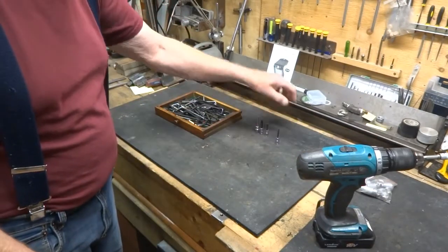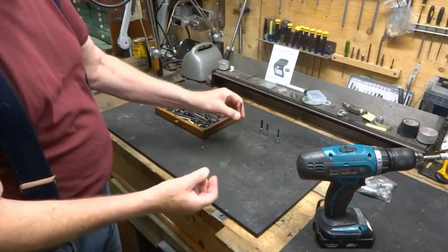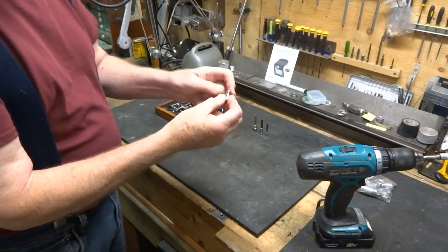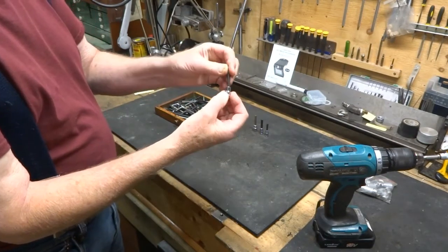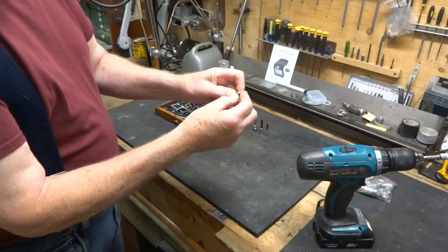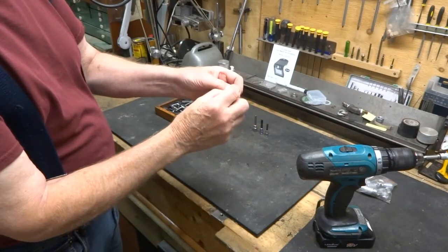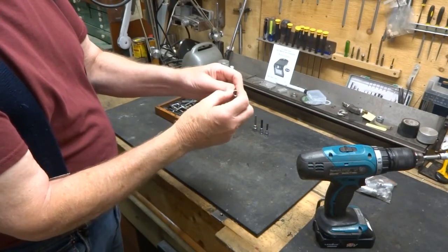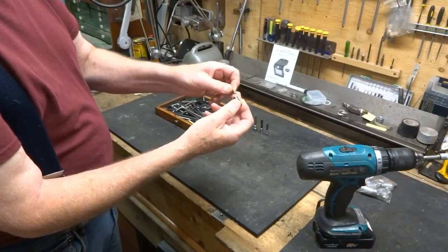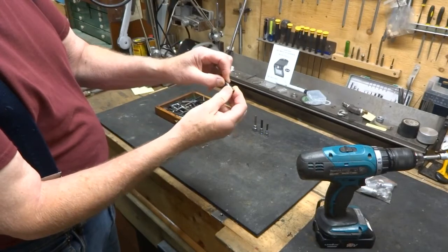What you have to do is find a socket where the piece of Allen wrench will fit in. If that can't be done — as in this case, I couldn't find one that fit properly and it was very sloppy — you'll find there's a little bit of material between the hex drive part and the square part, and you can drill that out to an appropriate size, then turn your Allen wrench part down till it fits in the hole.